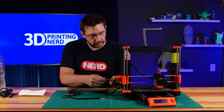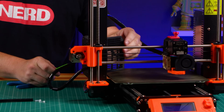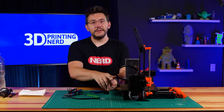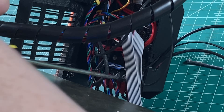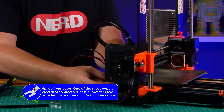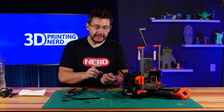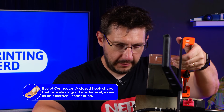The control box has one single screw that you can undo with a 2.5 millimeter hex drive, and that bolt attaches to a nut within the door so it swings open. Once that's open we get to look at where the wires connect, and this is where we undo the wires so the bed wires are free from the control box. The bed wires are connected to these two power posts and are screwed down. They are just spade connectors attached via a screw-down terminal, which makes for a nice, safe, good connection.